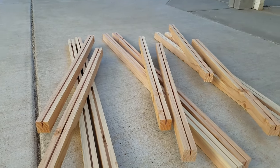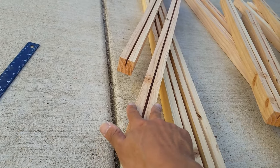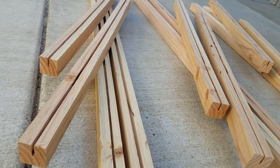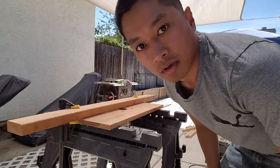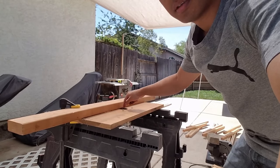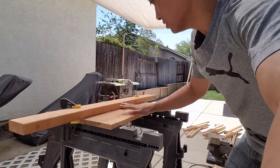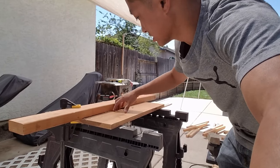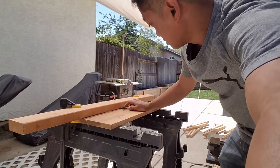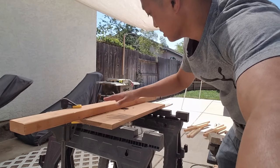It works well, just so I can make everything even. This is pretty much the frame pieces for the lattice, and once that's done I can put everything together. I'm not sure if I want to router the edge decoratively or something — I was thinking of it, but it's pretty much all gonna be painted white. I'll have to go through the pieces and see what needs touch-up. So I got my router jig set up now — you want to make sure you know the rotation of your bit when doing this. I believe it rotates this way; you want the piece pushed up against whatever fence you have, otherwise it can shoot it out. I'm gonna have to do two passes because this is kind of shallow — I'll do one pass on each piece and then raise it and do it again.